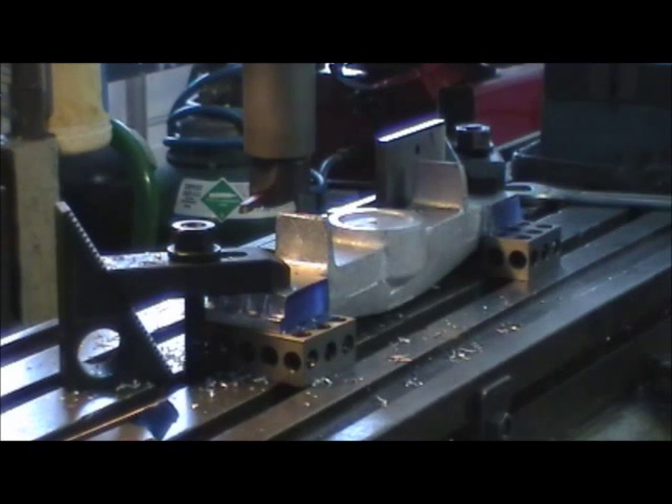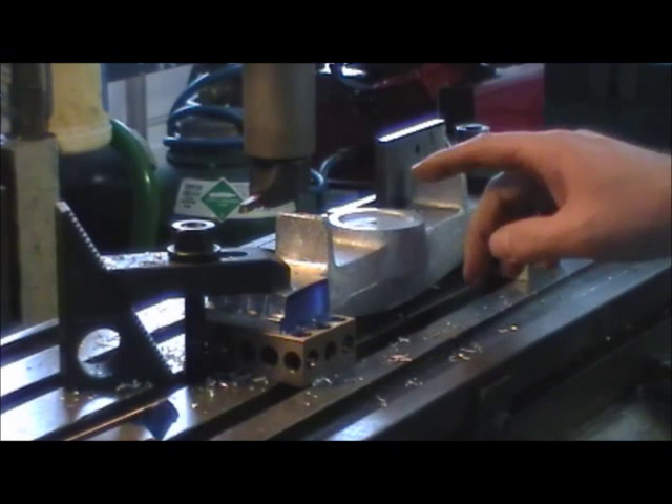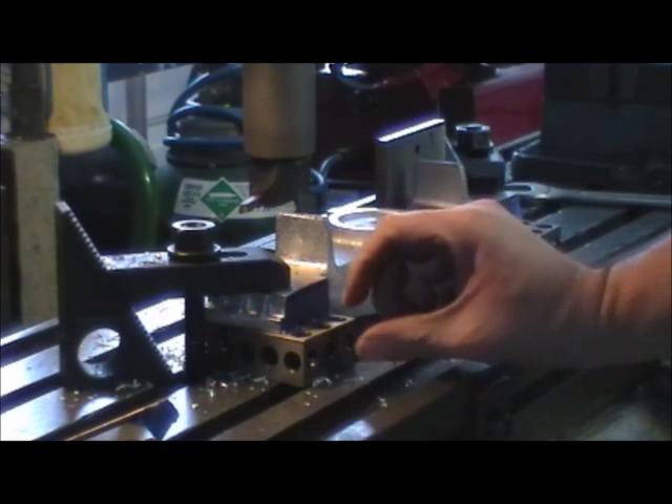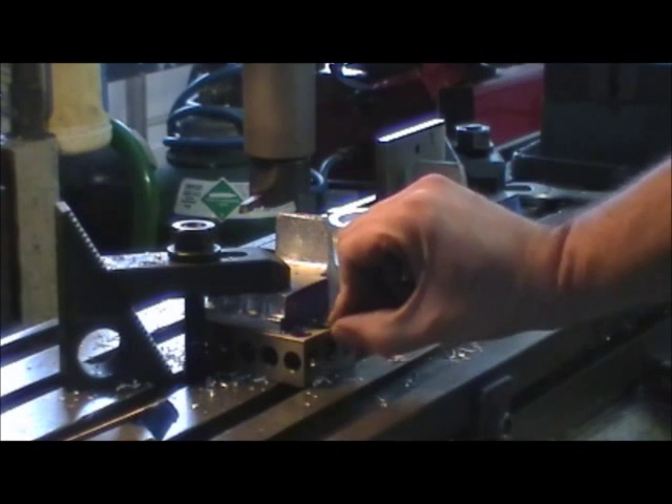I think it's a decent way to do that. Being that we're still referenced, I haven't moved anything, I still have my fly cutter set up. We're at two inches — this actually is two and an eighth. Take off an inch for the block, so it's an inch and an eighth from that surface — so that, as a reference surface, that'll work. It's good — I mean, for future machining it's a decent part of the casting. So let's go ahead and throw in the next one and just take that off, and we end up with a nice clean surface.